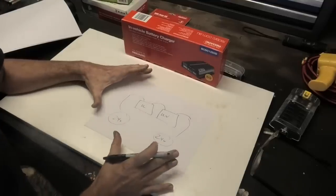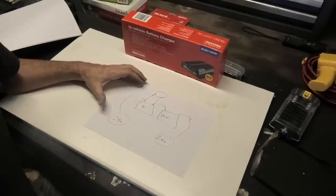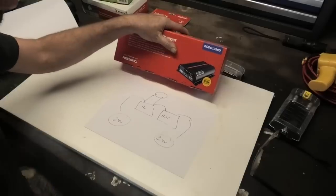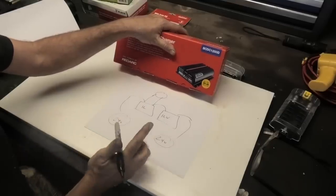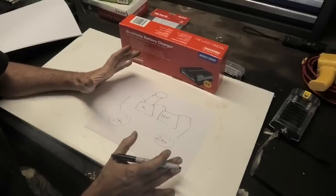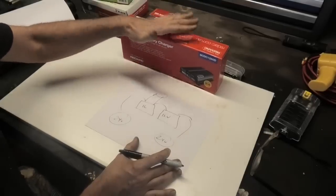This all charges fine, but the rest of the 12-volt electrics on the boat just came off one battery, which is a really, really bad idea. That's when Chris took me over to a Redarc poster and said you need one of these — this will solve all that kind of problem and do it correctly. There are two ways to do this: one is to run a second 12-volt alternator off a second belt. There are definitely advantages to that setup too, but the Redarc solution solved even more problems, so I think it's going to be a really elegant solution for this trawler.